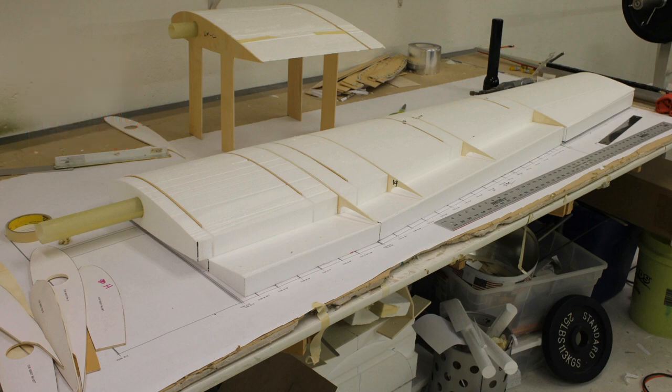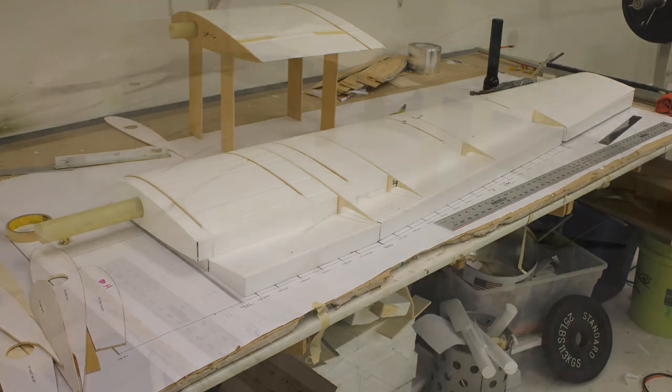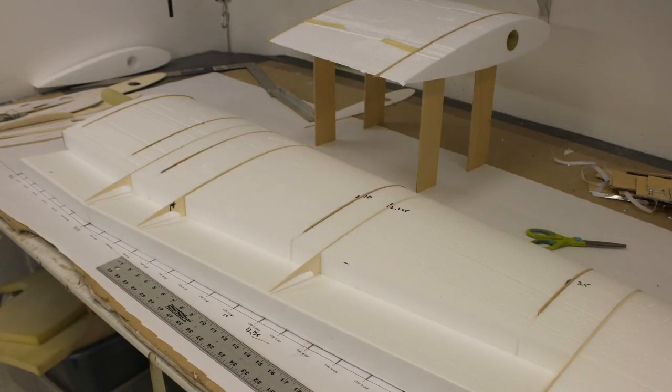You've got to be really careful about your wing joiner tube — I make my own out of fiberglass. You must make sure that where the hole goes through all your ribs makes the top of your wing at zero dihedral. You don't want it to go through the middle of the wing. On the C-130, the top skin of the wing was zero dihedral. Here's another picture of them temporarily laying in there.